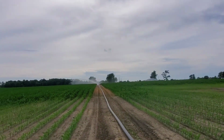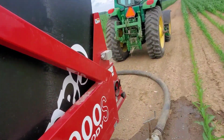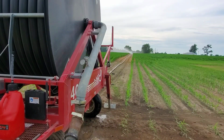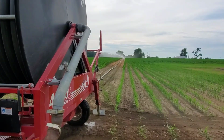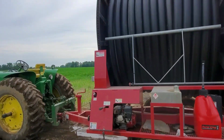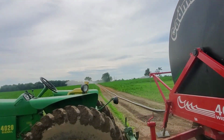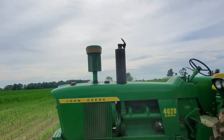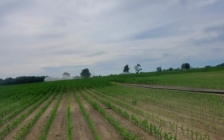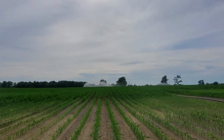860 feet. We got her running. I gotta figure out how long that one's gonna take. Longer than I thought there. All right, I decided to speed this one up. We're gonna run her at 30 inches a minute instead of 24. Put about 8/10 of an inch of rain on instead of an inch, because that gets it done at about 11:15 tonight. So I won't have to wait around as long. It was gonna be 12:30 I think before.